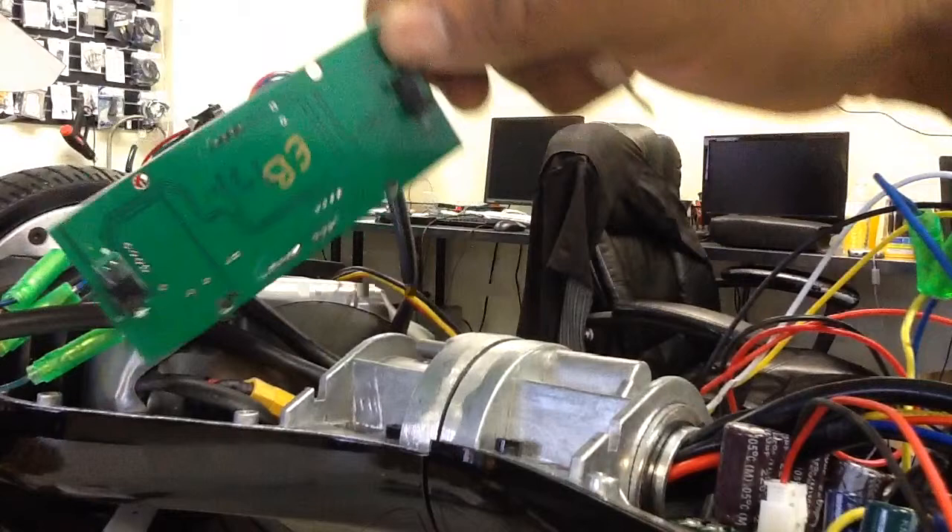The only difference between these two motherboards is that one has a socket for this particular wire while the other has the wire soldered into the board, but they both operate the same way. You just need the wire harness that goes into the socket for one, while on the other you plug it directly into the motherboard harness. Now that concludes my video on hoverboard posture sensors, balancing sensors, whatever you or anyone else may call them. Now you are fully aware of how they operate, how they go bad, and the difference between them. Thank you for watching.